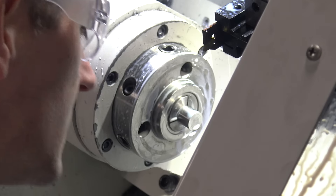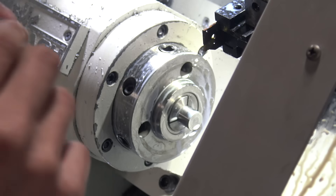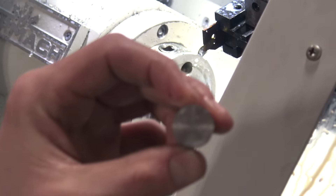Running pretty slow — 100 surface feet per minute — both on the facing, which I'm not too worried about, and the parting, which is a little bit tougher to do. Although actually really not that hard. And that's kind of what I'm excited to see about on this video: it's tool steel, but we can machine it. We can work with it. Look.